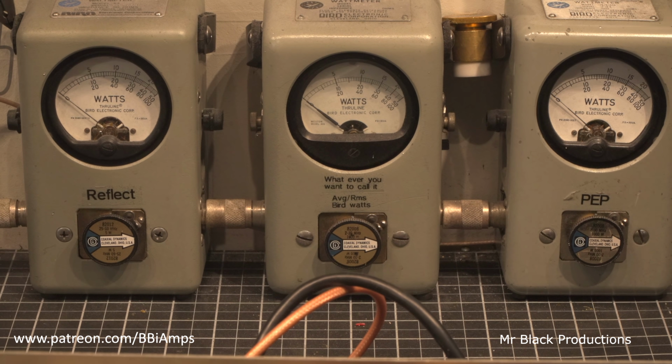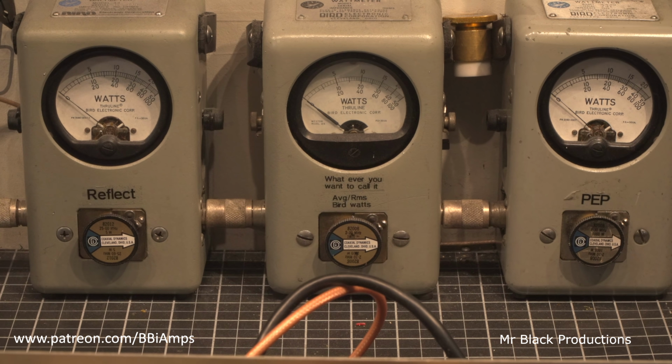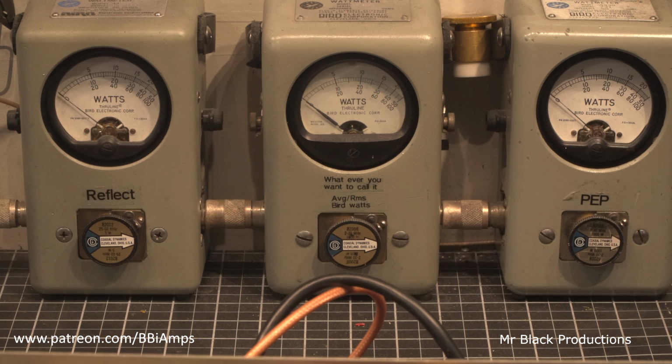We're going to start over here on the 5 watt element. We're going to go ahead, we'll key the radio up here. And we're at a half watt carrier, and the amp is still not engaged. Remember where we are in operate. So there's 1 watt worth of carrier, 1.5 watts of carrier, 2 watts worth of carrier.